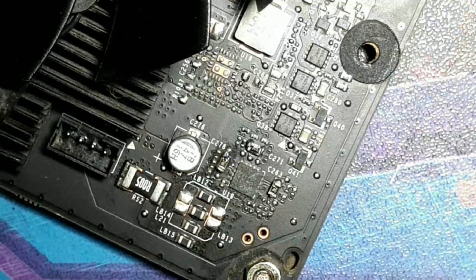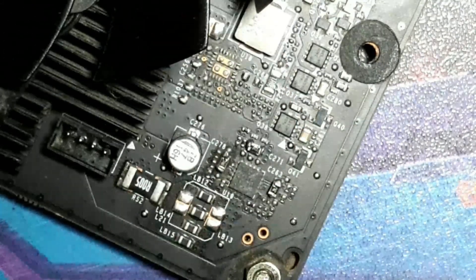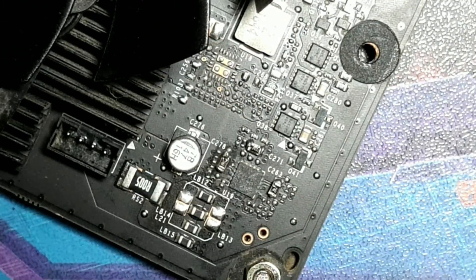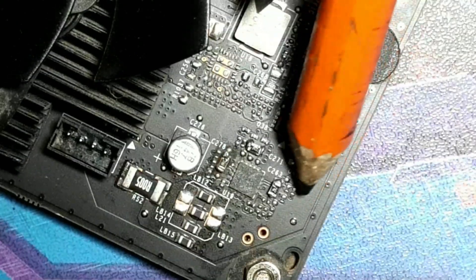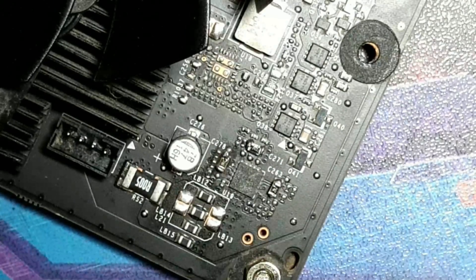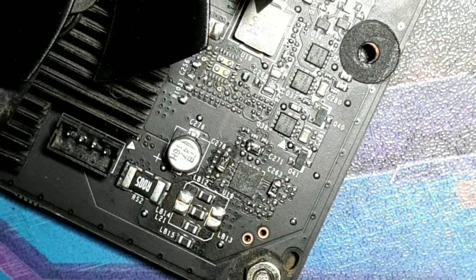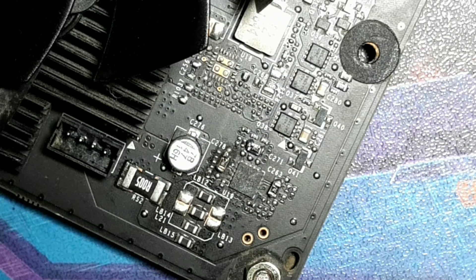Everything's solid - lifting the board, nothing falls off, nice and stable. Normally on EVGA models you'd just do the two PCI Express power shunts. The shunt mod makes it read very little power - if my math is correct, it should only read maybe 3 to 10 watts under load through the PCI Express power connectors and slot to the motherboard.